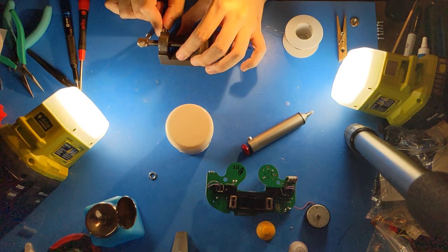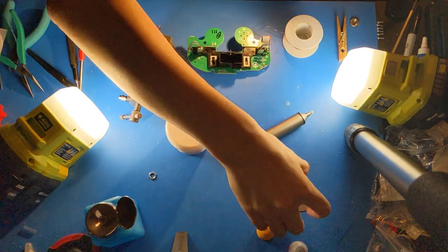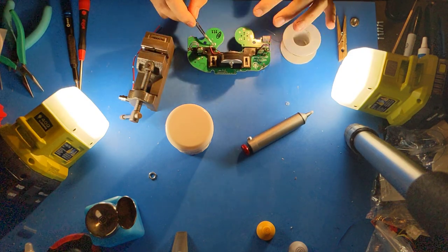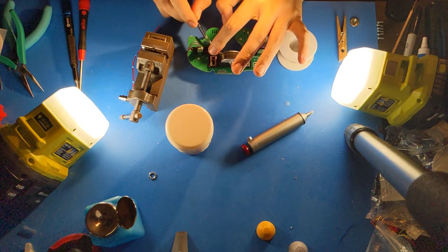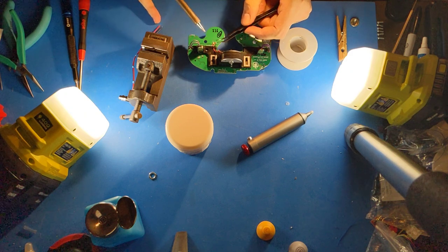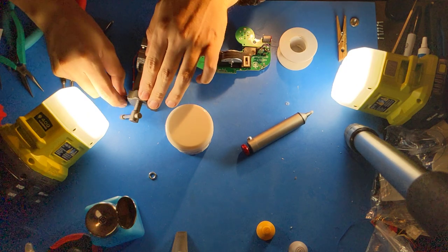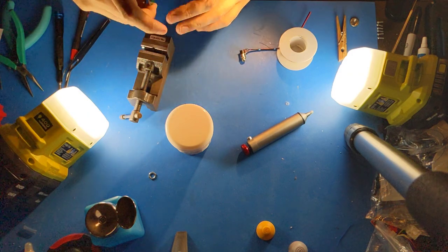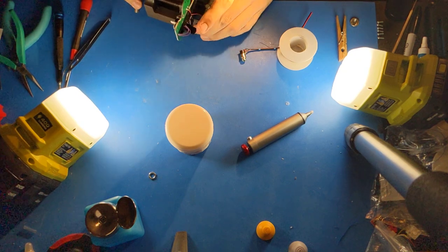For now, by sticking it to the side here. And next, I will install the rumble motor. Because of the close proximity of the rumble motor wires to the PhobVision holes, we have to solder this in first. Simply take the wire and melt the pool of solder that was already there and hold it in place. Super easy. Now we take this, and remember I pre-tinned the holes for PhobVision. I will grab the motherboard and my vise.